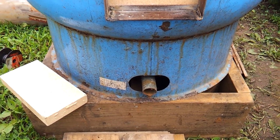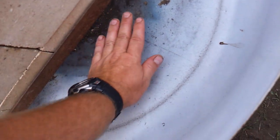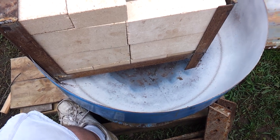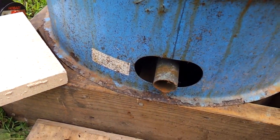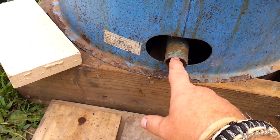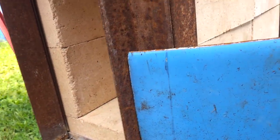I may also be working on an ash pit out of the bottom. I know when the flue gases are coming out, ash will fall down into the bottom and there's an awful lot of space that can take up ash — I wouldn't have to clean it out very often. Maybe that's something I'll work on next season. Right now I have this tube that goes in there into a hole in the bottom, and I might be able to use that as a primer — stick a vacuum cleaner on it to get some negative pressure. It's a design-as-you-go situation.